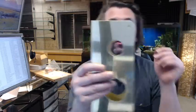When you remove your latches from the door, they may only have wood thread, so obviously that wouldn't work, and Donjo provides those screws. You'd get this plate into the door, secure it down, then you'd be able to fasten your latch bolts directly to these preparations with the screws provided.